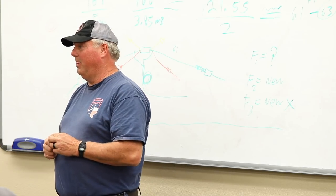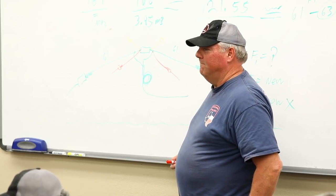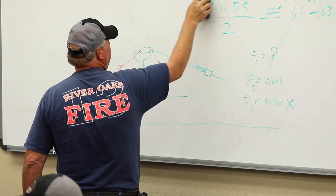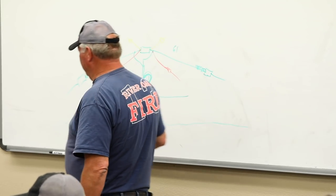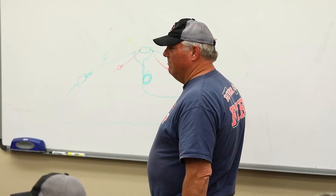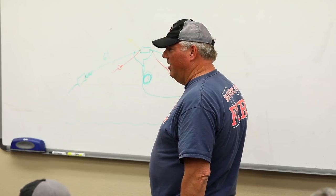All right, let's say you want to work all folks in all directions. Now, we know that a dipole transmits this way. I had a fellow out of Colorado, by Colorado Springs, on a MARS frequency. He put a dipole going north and south and a dipole going east and west. And all of them had to be dead on. I mean, all the lengths had to be dead on. I said, how is it possible that something could transmit this way and that way at the same time? And you phased them, right?